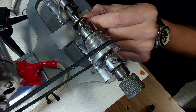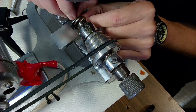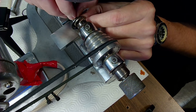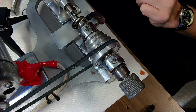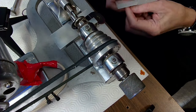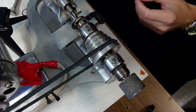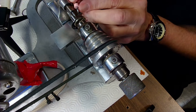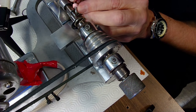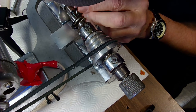I want to make sure the bit is not too big. I can take it out and measure it against the 0.3 millimeter bit to make sure it's the right size. I grab these 0.3 millimeter bits and measure one against the other bit — I think they're probably the same size. I can also use the Douzième gauge to confirm they're the same size.